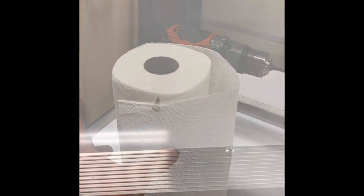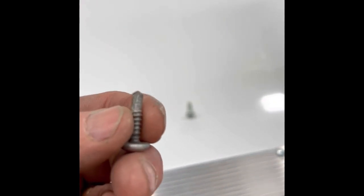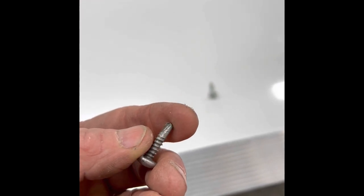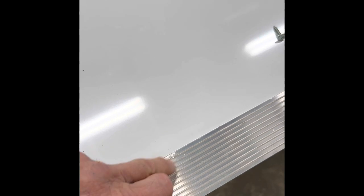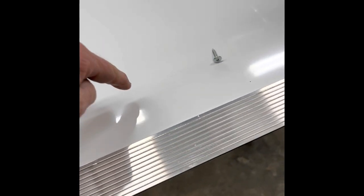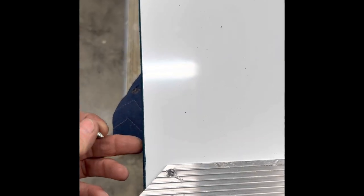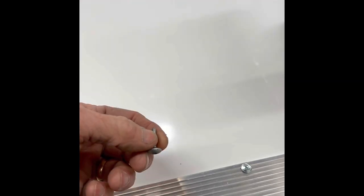Here's a note: this screw is what the manufacturer put in the door. It has a self-drilling tip designed for metal-to-metal applications. But we're going through metal into wood. So I'm using a three-quarter inch pan-head screw, which holds better into the wood. The self-drilling tip pre-drills and leaves minimal thread to bite. It amazes me that the manufacturer didn't think those processes out.